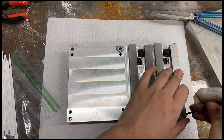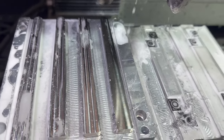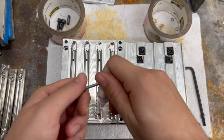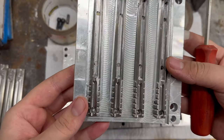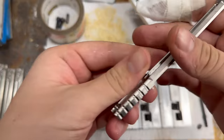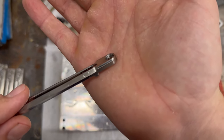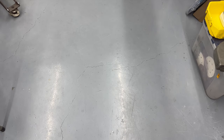Now that the assembly test is done, it's time to run another set of handles and fix these problems. With this batch, I start by machining them down lower so that there's more material to take off the top — whereas the first ones had very little material left over. As you can see, there's no burr or anything left over on these, and so they ended up machining much better. You can immediately see they look a lot better. However, I did end up running an old program, which caused my rounding bit to go in the wrong place — you can see that top corner has a weird step on it. This isn't a huge functional issue, but it blems the entire set, so I go ahead and fix that and run another set.